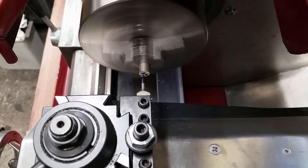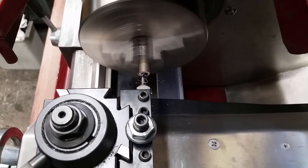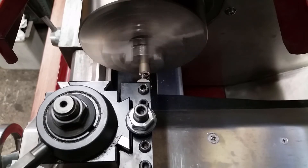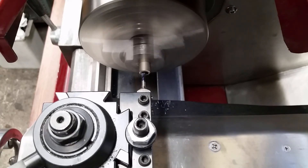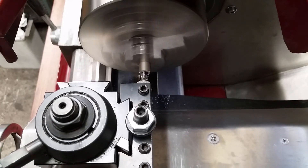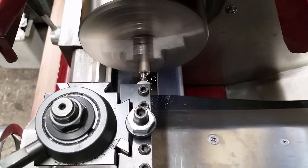Time for a test run. This is a tougher stainless steel tube — the alloy is 1.4301. This material is common when I am doing lathe work, so it's a good way to test these boring bars. Both boring bars seem to work just fine, but I will order a few more. Out of experience I know that I will break them sooner or later.